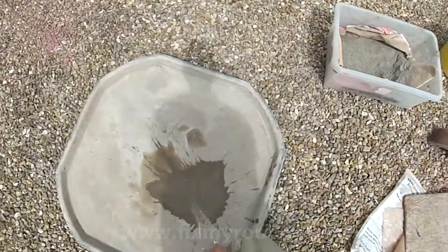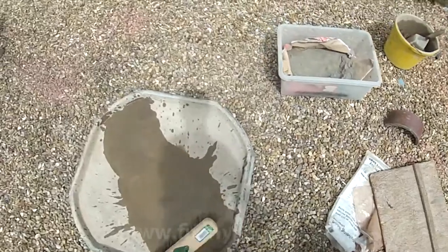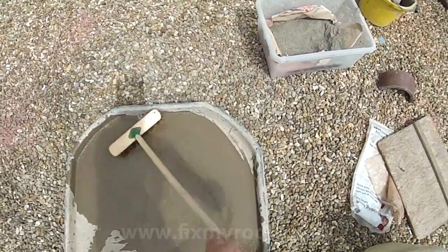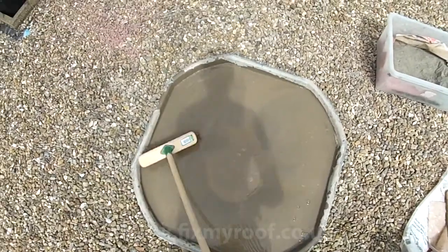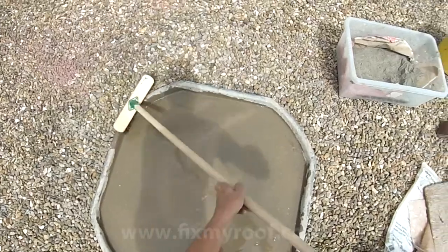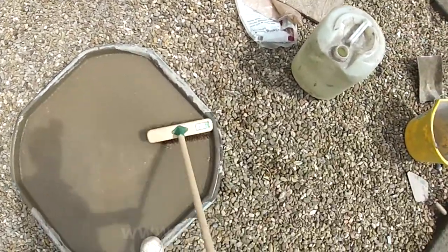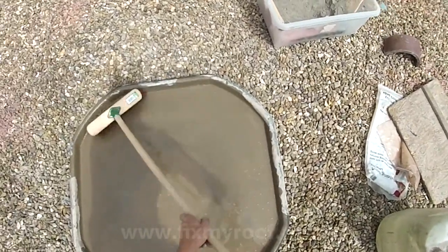Now it's time to give the spot a quick bath. There's no need to go crazy with the water — two to three pints is more than adequate. One of the benefits of a spot mix over a cement mixer is how easy it is to clean afterwards and how little water you actually need. Using a stiff bristle brush, just wash the water around the spot and any of the last bits of surface mortar simply lift off or become so diluted that they lose all strength.